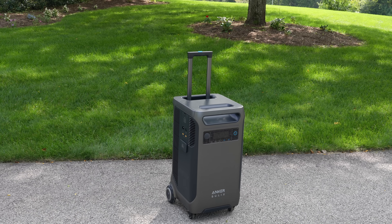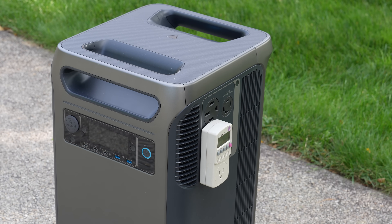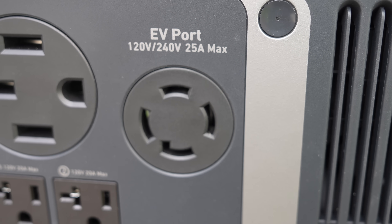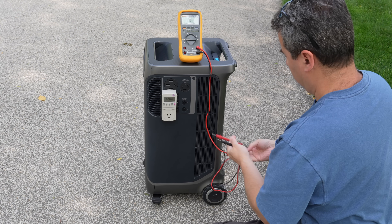This Anker isn't the first product that can do 240 volts, but until now you always had to buy a pair of devices along with some type of a combiner box. But this one is the holy grail of outlets — it's the L1430, a 240 volt outlet that is a common standard in the US on gasoline generators.